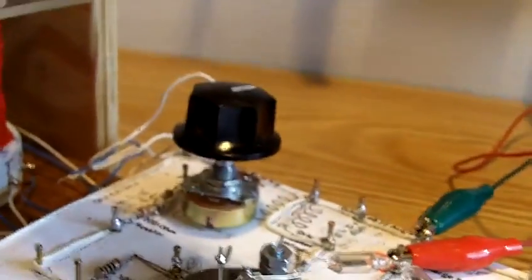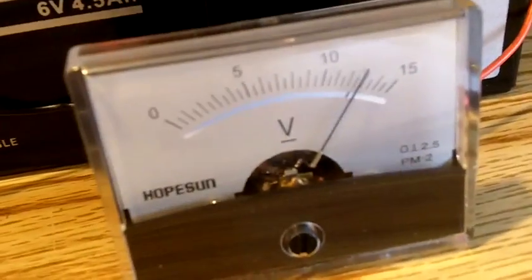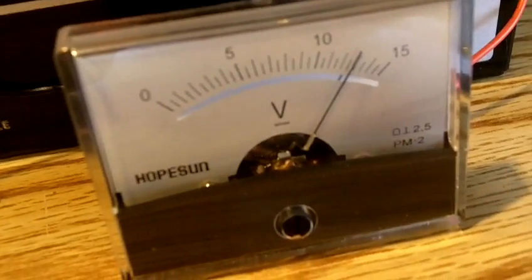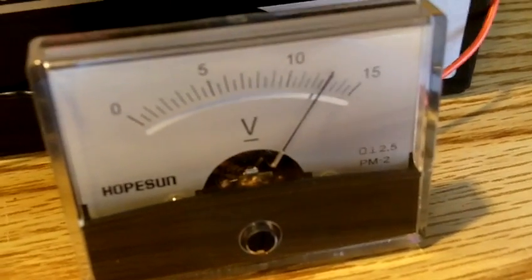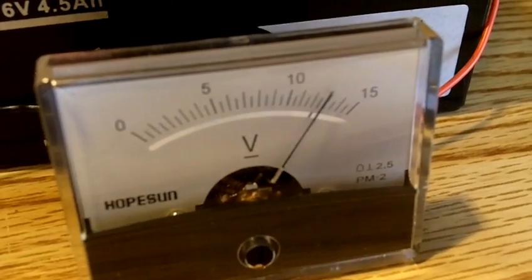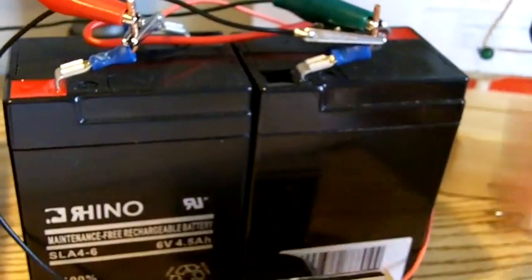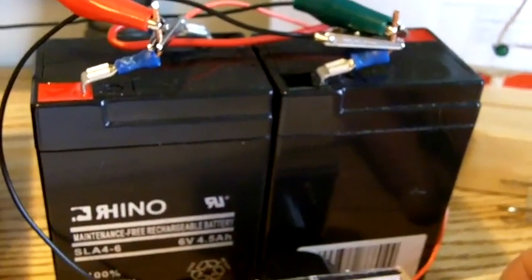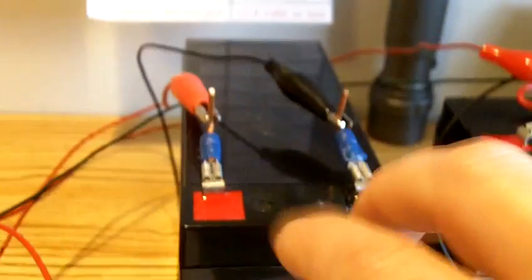I checked that with my little meter here — it works quite well. Right now I'm charging these two batteries here; it seems to work quite well. I've got a little over 12 and three-quarter volts. These are two 6-volt batteries that I have in series — I had one battery and wanted to get 12 volts, so I went and bought another one and put them in series. And this is another 12-volt battery, which is my run battery powering this unit.